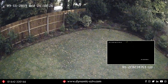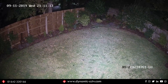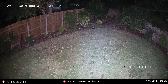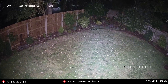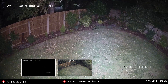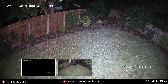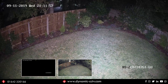Lastly, we've got the ColorView camera again with the white light enabled. The white light will come on when the lux level drops below the minimum level the camera can handle under normal conditions. If you put the switching sensitivity to 7, that will keep the ColorView operating without the white light up until the lowest point of 0.0014 lux, at which point the white light comes on. As you can see, a much smoother, crisper, sharper image with full colour information in the stream - a massive advantage over a mono IR-lit image with minimal noise.